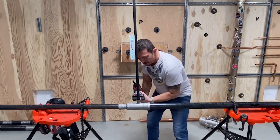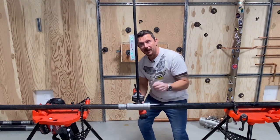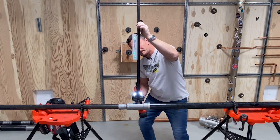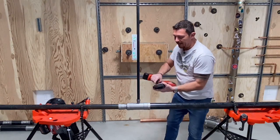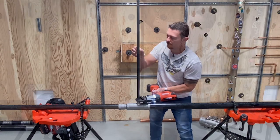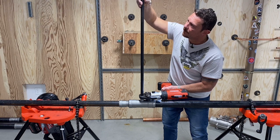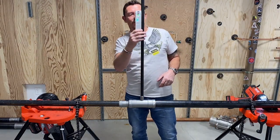We're going to use our half-inch jaw. I'm going to press from behind here. The pipe is going to want to come this way because the fitting is trying to go that way. But I've got my level here and I'm going to hold things level and start my press. I can release my tool by releasing the ram and come over here and check my level. Then I can go ahead and make my press to finish it off nice and plumb.